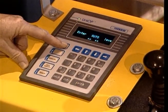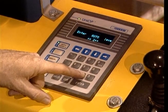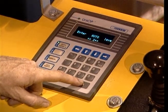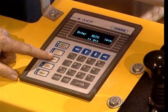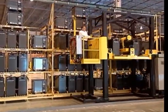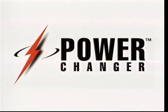Once the battery has been placed on the power changer carriage, you will be required to enter the level number of your next target area. This can be a forklift, a wash station, or another rack location. If at any time you find it necessary to switch to the manual mode, simply press F3 and enter, and the power changer will return to full operator control. A supplemental programming guide has been supplied with your power changer that details programming operation in a step-by-step format.